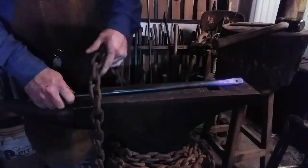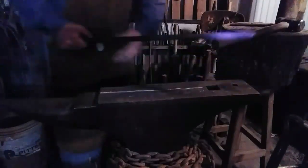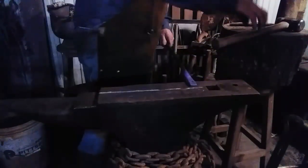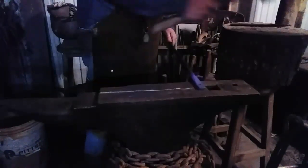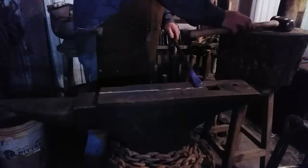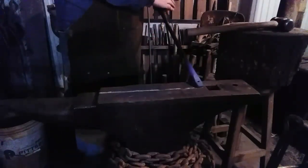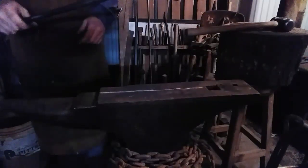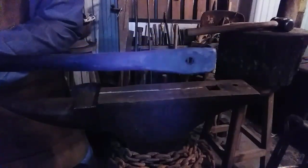That's your goal. It might take you 3, 4, 5 heats. Whatever it takes for you to punch your holes, you learn over time. You get quicker at it. Notice I hit my hand one time, but I felt myself missing and held back so my hand's not hurt. These are things you learn with practice. And there's your nice clean hole, no rag.